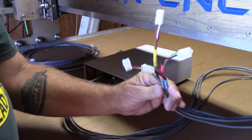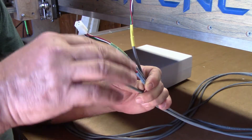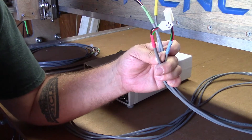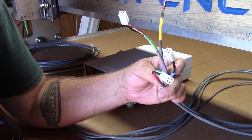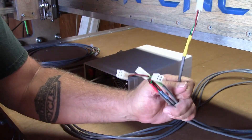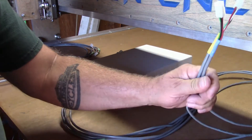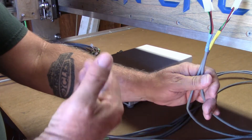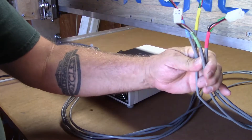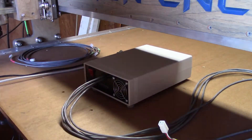The cables coming out of the box are all color coded, and it's real easy to hook it up — and real difficult to mess it up, as long as you pay attention to the color code. Your drive box will come with documentation. Basically, yellow is your Y axis, blue is your A axis, and these two are going to be slaved together in our case, with the gantry moving in the Y axis. Red is the X axis, and green is the Z axis. That's basically all you need to know — if you can keep those four colors straight, you've got this.